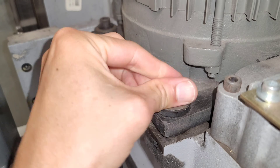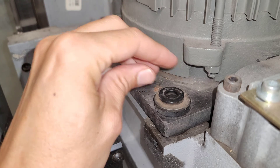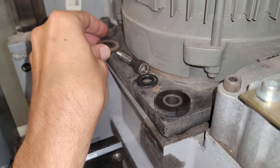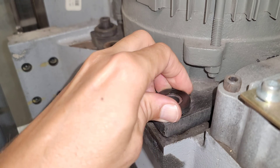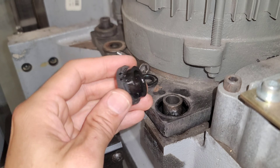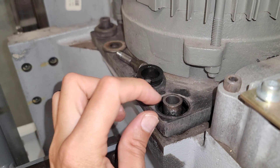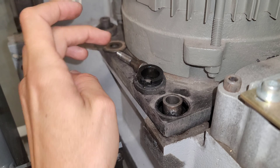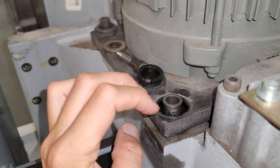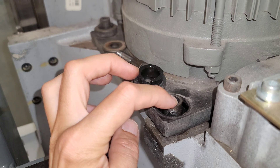This is how these vibration isolation mounts are made: there's a central bolt — a socket head cap screw — then a small washer, and then a large washer. Here's the rubber mount, with probably an identical one underneath. There's a central metal cylinder that the clamping force of the bolt passes through, so the bolt clamps down against that cylinder, not against the motor mount itself. The motor mount is completely isolated with rubber, so when you tighten the screw, you're tightening it against the internal metal cylinder.